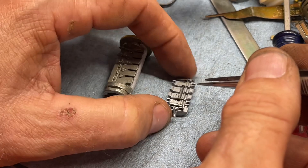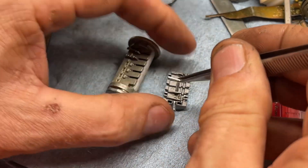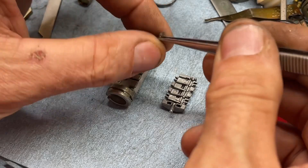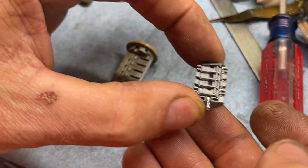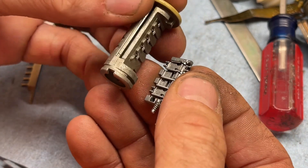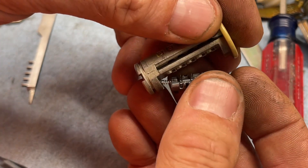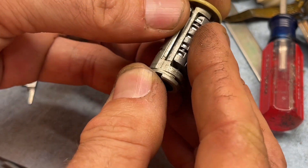Center it right there on the sidebar. Make sure you put your wafers up and then put it back together and squeeze it just like you do a regular Smart Key. These are actually a little bit easier because they almost stay in position. Now remember when putting this on, each one of those little grooves in the wafers has to slide in — it seems like it would be counterproductive — but it actually does kind of work. Watch your spring.